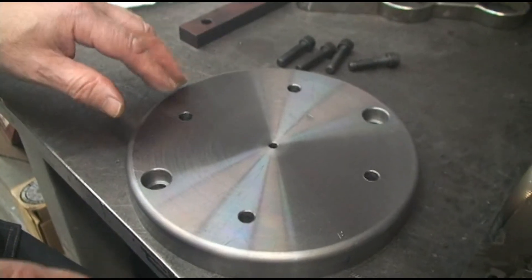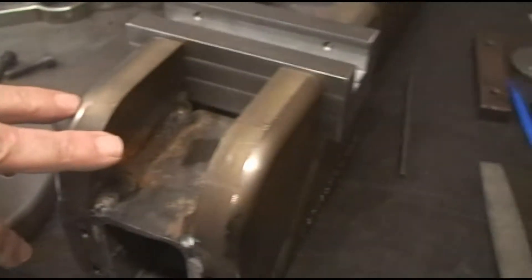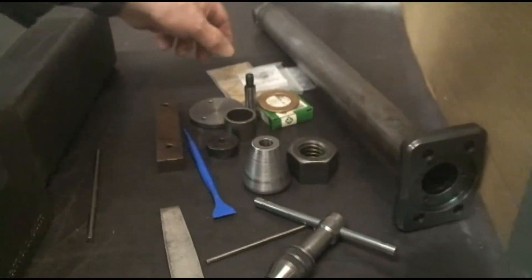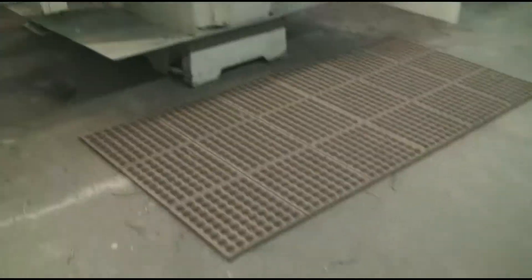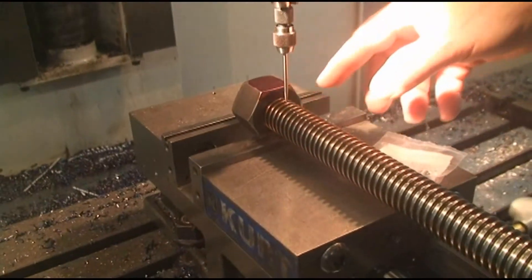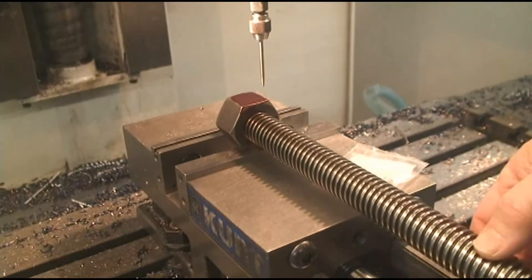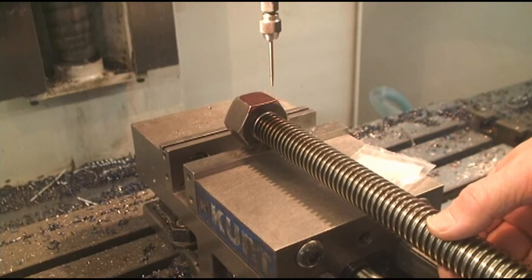Here's the base again, which is going to be screwed on here. I want to now assemble this and one of the early things that has to be done is to mount some cap screws in here so that the screw can go right. We've got two 5/16ths-18 cap screws here which I would like to have hit onto the top of the screw. To do that, I picked up this screw by screwing it into the nut and set it in here. I'm X distance away and right over the top. I'll back the screw out and go a certain number of pitches of the screw, which happens to be two hundred thousandths, which is one inch from here.